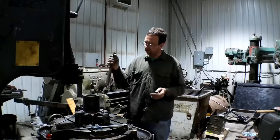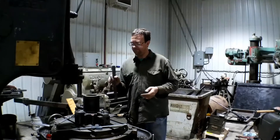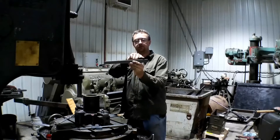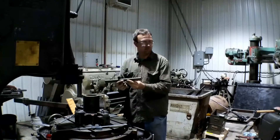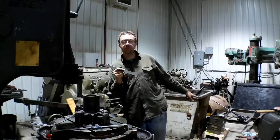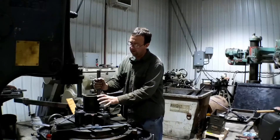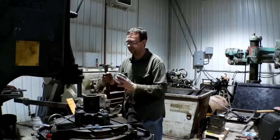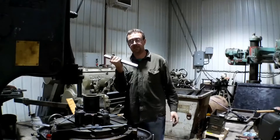Here's our key stock, and these are kind of a special key. They actually get milled out. We'll cut the key a little long and then mill out a slot so that it goes into that first piece, locks in there, and then slides on here. That's so it can't come out - the keys float there and ride there. So the next step is to make these keys.